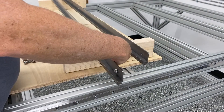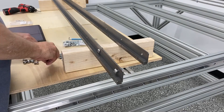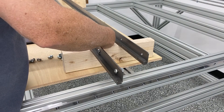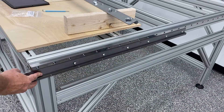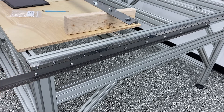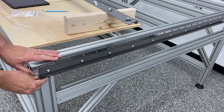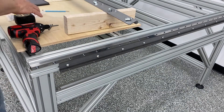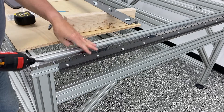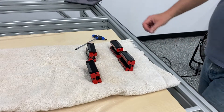After you get the linear rail in place, go ahead and get the T-nuts and the bolts in the gear track installed and slide that in place on the lower portion of the extrusion rail. As you see me doing here, that doesn't get aligned with that aluminum jig — it just gets put in place with a specific measurement, I think it's like four inches in from the front of the extrusion. Once it's in place, tighten that down. You'll repeat that step on both sides; I'm only showing one side.